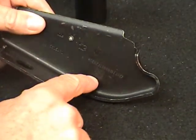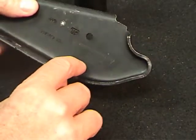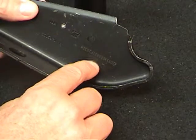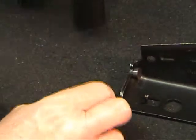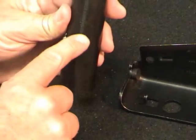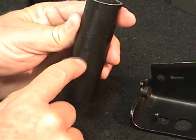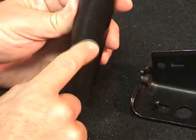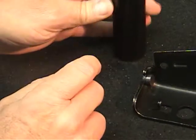This one is a pin marked part, and if I move that around you'll be able to see the pin mark on that. This has been pin marked and then E-coated or painted over. There is also the ability to read on curved surfaces, and actually this code is really scratched up, but we can read a part that was direct part marked with a pin marking, E-coated over, on a curved surface.